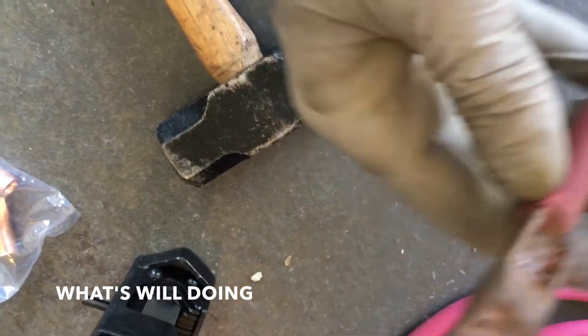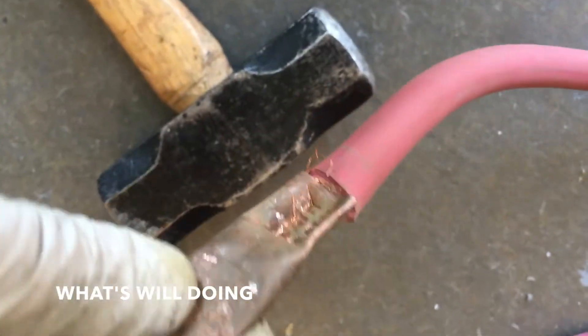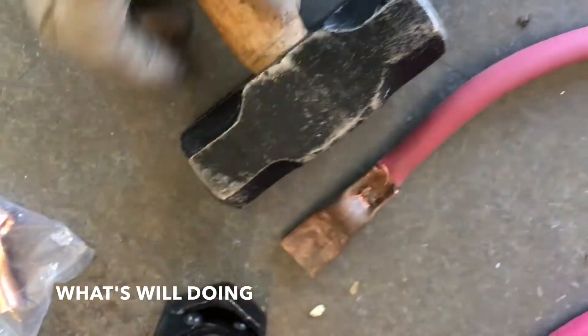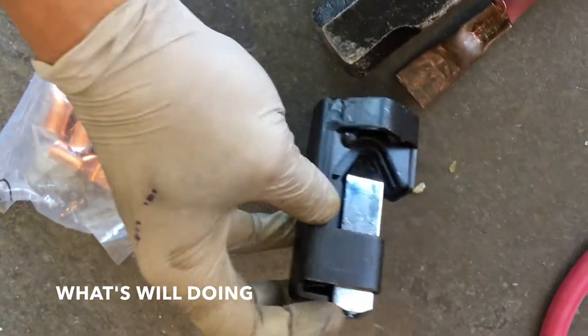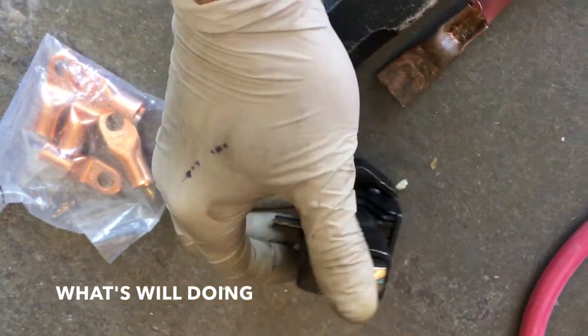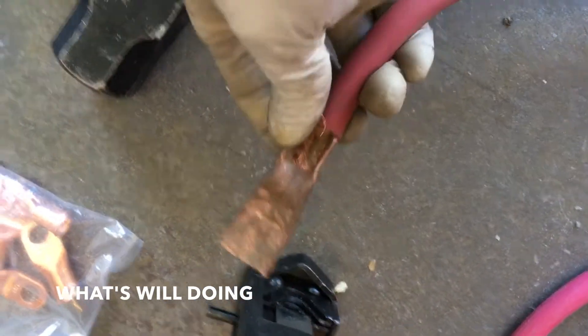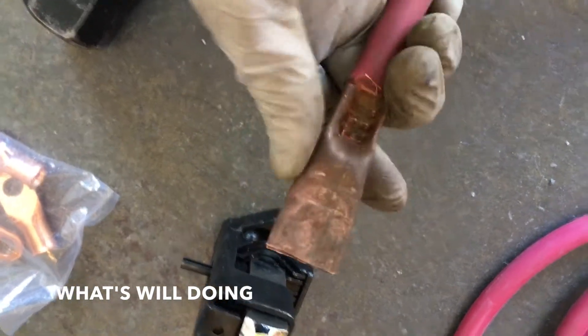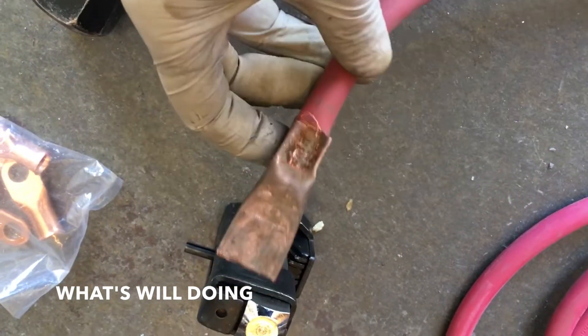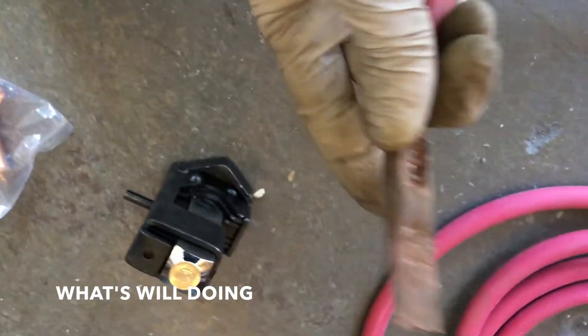This looks really nice — just a piece of copper pipe that I've crimped on to the end of this cable. That is a nice, tight crimp. You can see how deep that is in there. I'm really impressed with this tool — I think it was like $12 on Amazon. You just take a nice heavy hammer, slam it a couple times onto this cable end, and that is crimped on there nice. This is going to be the ticket for getting the ends on the cable. I'm going to test this out in the vise — clamp this, grab the cable, and just yank around on it to see if I can get it to come out. I think that's in there solid.